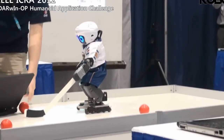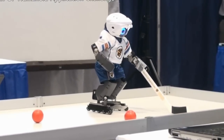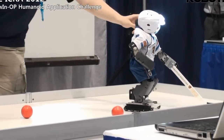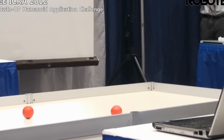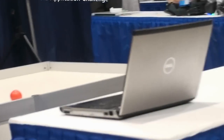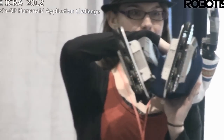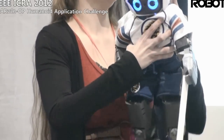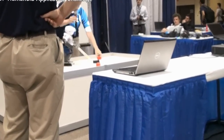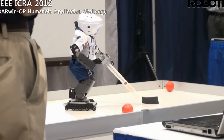We focused our research mainly on the push phase of skating — without a strong push, we just can't glide. Future work is to get that sustained glide motion we saw in the speed skating video. If you look at the robot's foot motions, they're largely across the coronal plane with very little motion forwards and backwards. We do have a little bit of a kick at the end to compensate for drag from the stick on the ground — otherwise the robot starts leaning left and skates in circles. The robot is programmed to skate, find a ball, track which side of the stick it's on, and determine whether to do a forehand or backhand shot.